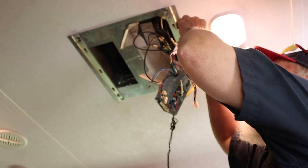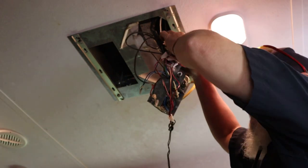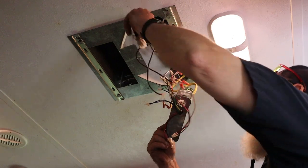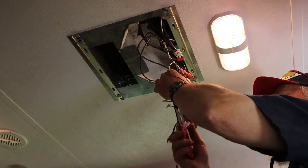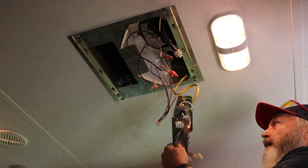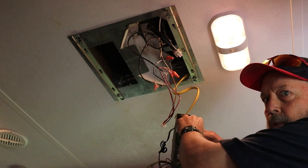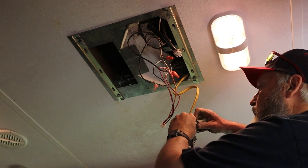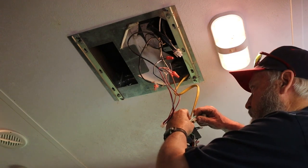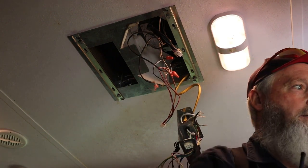I sure hope this audio is working, because this is a brand new camera and it does not display the audio. I'm assuming the audio is working, but I don't know for sure. Let's just unplug our upper unit. We know our power is off over here. Two more control wires to cut loose here. I'm going to get our 110-volt AC wires undone. I know the power is off on this because we cut the breaker off. And if it ain't off, I'm going to see me jump in a minute as my heart is restarted. No electricity.